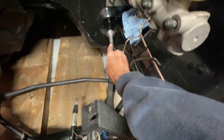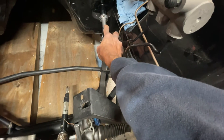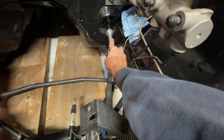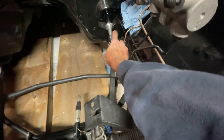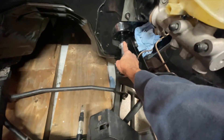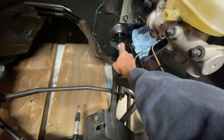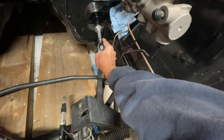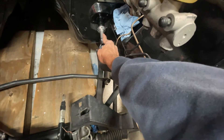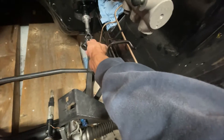Once you get it set, drill your hole all the way through. I wouldn't recommend welding that U-joint to the shaft because one, it's a tighter tolerance and you risk warping it, and more importantly you'll never be able to take the inner shaft off and replace the replaceable rubber or plastic bushing if you weld the U-joint onto the inner shaft. So drill a hole through, put a bolt and nut, make sure it's tight — tight like a tiger — and that'll be good.